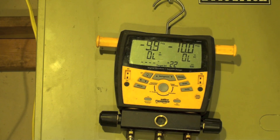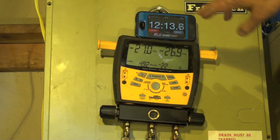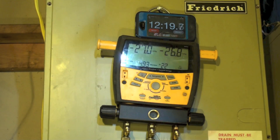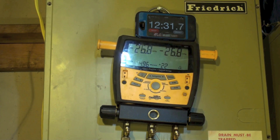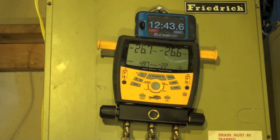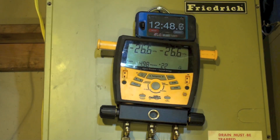You can see I put a stopwatch in here — we're about 12 minutes into this. We're showing 490 microns. I know the gauge up here says 26.9 or something. I just calibrated this — I don't think the pressure parts are that accurate when we get down here. We're showing a pretty good vacuum there, and I've shut the valve off at the vacuum pump so we're seeing what vacuum is staying in there.